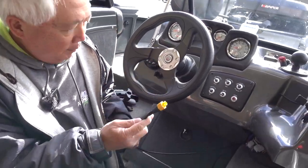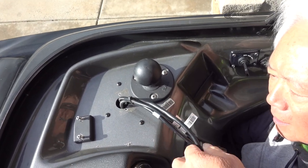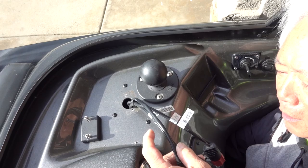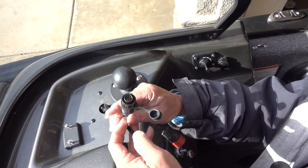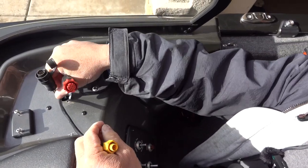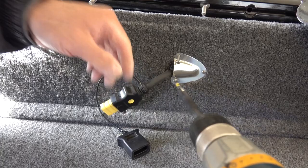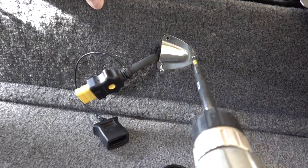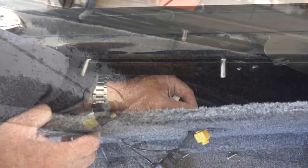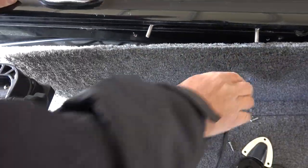Find a wire that's already strung through there with a little slack, and then you'll be able to pull your Ethernet cable through — coming out the top here. Sometimes you can't get these wires through because the hole isn't big enough, so push the larger connector back down and pull the smaller one up first, then pull everything through without trouble. I'm removing this panel — the hole is already here — so I put my Ethernet cable out and then run the power cord to the unit.